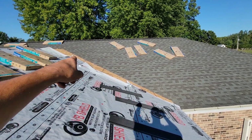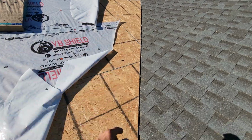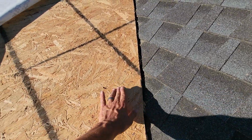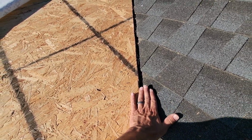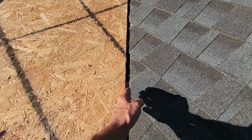We're going to then put a piece of coil stock down the middle of this, because the builders, at least on the other side, there's quite a bit of a gap here. It's not going to take much metal, just a small thin piece. Tack it down so it's supporting the shingles a little bit better. On the other side, there's a little bigger gap. You don't want the finished product, somebody to be up here, walk in it and smash it.